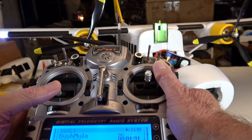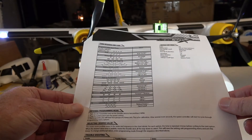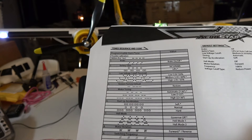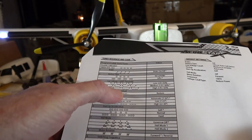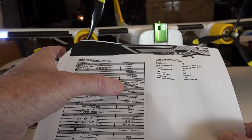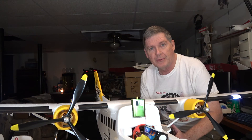That's how simple it is. Most ESCs have a manual like this that you can download, which has all the beep patterns listed in a table. There's a whole bunch of functions you can change — you just have to wait for that beep pattern and during the pattern move the throttle down to change the feature. So there are all these different features that can be affected. I hope that was helpful — just a simple way to set those features.